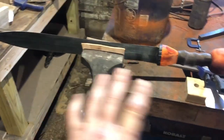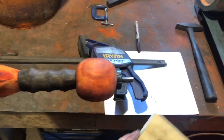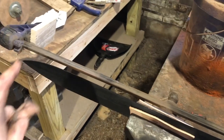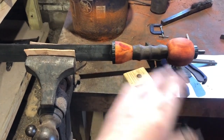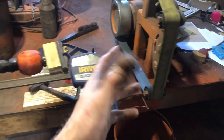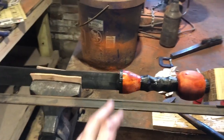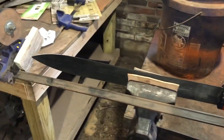Doing a dry fit, making sure everything's going to fit together real nice before any epoxy goes on. I happen to have a clamp big enough to fit the entire sword. Got a scrap chunk of two-by-four with a three-quarter inch hole to apply pressure on the back, and a piece of scrap wood super-glued to the end of the clamp. We'll mix up a big batch of epoxy, put the pieces on one at a time, clamp it up, and then go to lunch. Got it clamped up. Going to get some lunch while the epoxy sets, then cut the excess off the tang, peen it, and clean everything up — this thing's near about done.